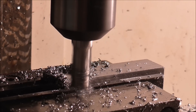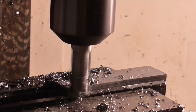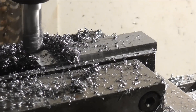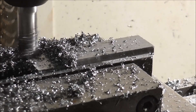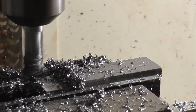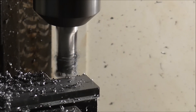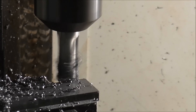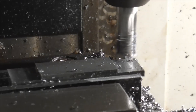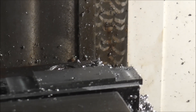We're just going to keep going through this stepping routine until we get down to that, and then it'll move along to the other one. We've just finished that step — I did three passes at about 0.5mm deep each time. Now we're going on to our next step, and after that we're on to spot drilling. We've got our step on each end and the overall piece is to length, so now I'm going to do a tool change and we will finish by spot drilling.